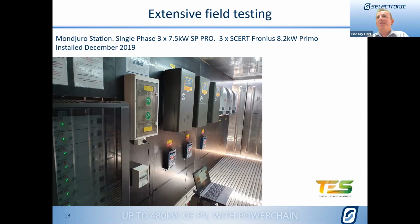Yeah. So while we're sitting there, there's a question up here. Do we only use a common battery bank? And yes, the common battery bank is used across all of the systems, and that allows, across multiple phase systems, the energy that's being generated by the PV to be shared across all phases through that common connection.